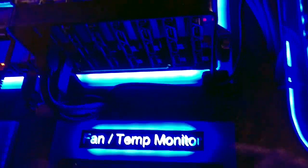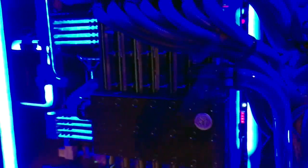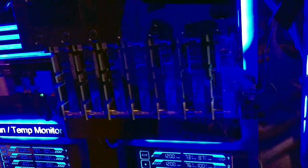All of these have had the DVI connectors cut off of them. You can see only this end one here has a DVI connector on it. The rest have been removed, the cases have been removed, and then a water block put on all of them. That's really the only way you can get 7 GPUs on any motherboard, since they're normally a two-space card.